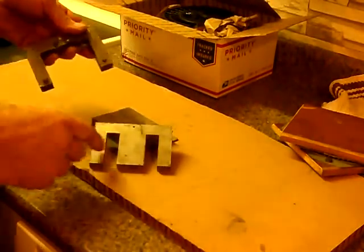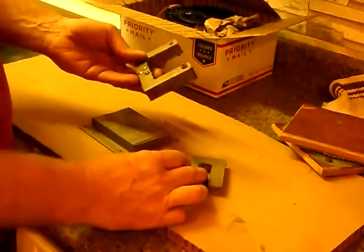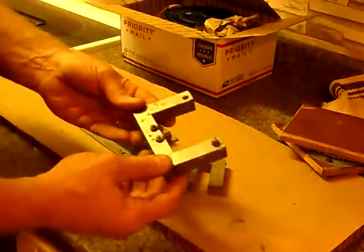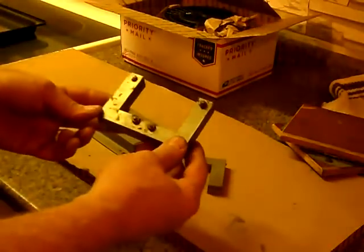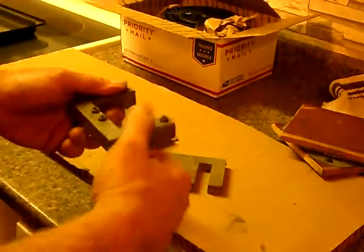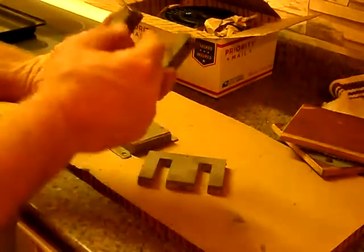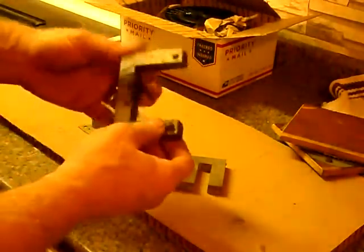I've got a ton of these transformers out back, and I'm going to start making these cores. But somebody wanted to know how you made a core, and then I put the spool up around it here, and put the protection here after I pulled the bolts out. I basically just bolted this and clamped it with vice grips. When I drill it, clamp it on each side or one side at a time and drill it, and then put your little teeny nut and bolt in and save your bolts for the next time.